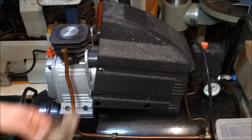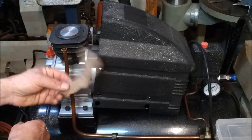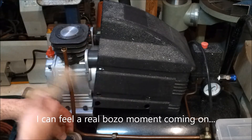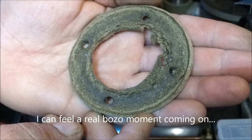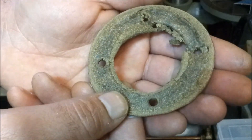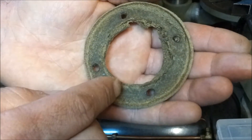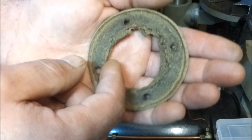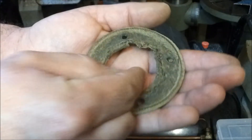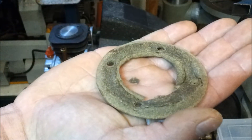Even though I didn't have the right gasket material, I thought I'd be clever and tried some cork nitrile rubber gasket material I had in stock — knowing full well it wasn't made to seal this type of compressor flange, but I gave it a go anyway because I was so close to finishing. Obviously it didn't work. You can see the gasket has just crumbled into pieces and is badly compressed. It actually failed on the third try at around 30 PSI — I did get it up to about 60 PSI twice briefly, but the third time it fell apart. Some cork material fell off on the inside and stopped the piston from cycling. Complete fail — that's what happens when you don't use the right material for the job.